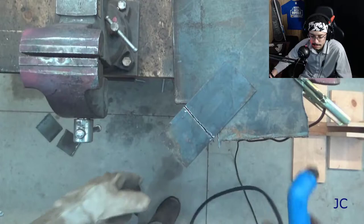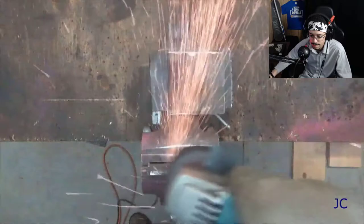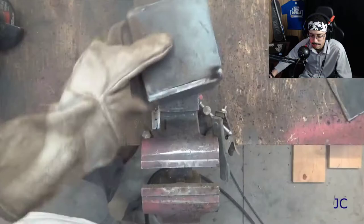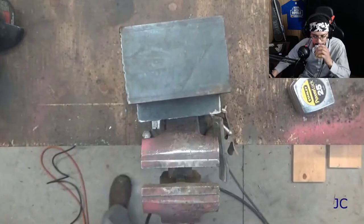For the base of the box, I went ahead and cut the piece of steel about two inches too wide. I used this as kind of a ledge to hold the glass in place once we got it built. We've got all the pieces cut out for the box. I'm just going to take the grinder and smooth out the edges where I cut with the plasma cutter — take off any paint or oxidation that might get in the way when we go to weld. Now that everything's cleaned up and ready to weld, do yourself a favor and use some light tack welds to hold the box together before you start putting huge welds on it. That way if something's wrong, you can take it apart. In the end, I wound up welding the inside and outside of the seams. I wanted it to be stout since we're going to be shooting at it.